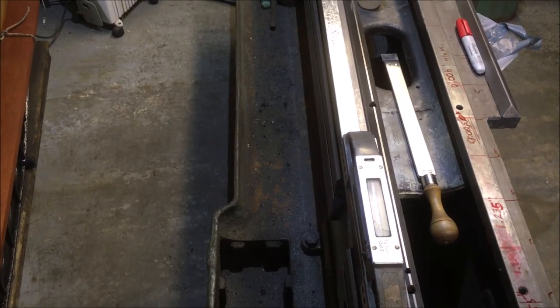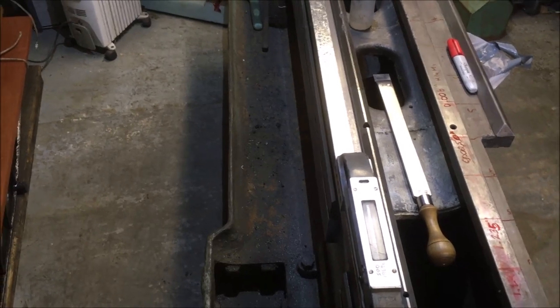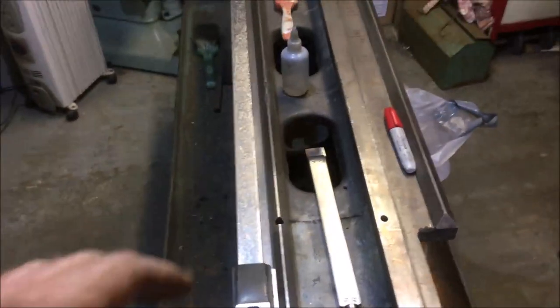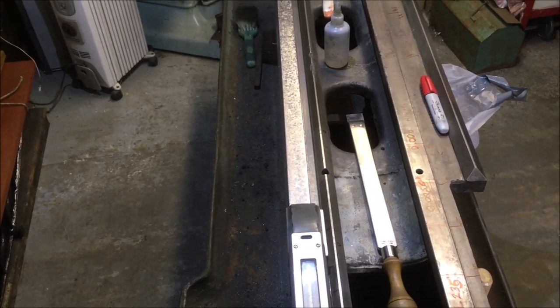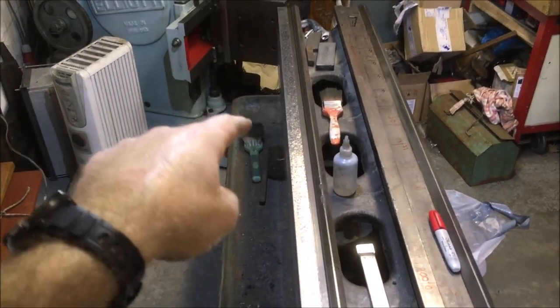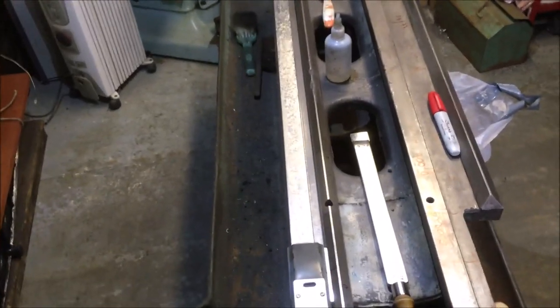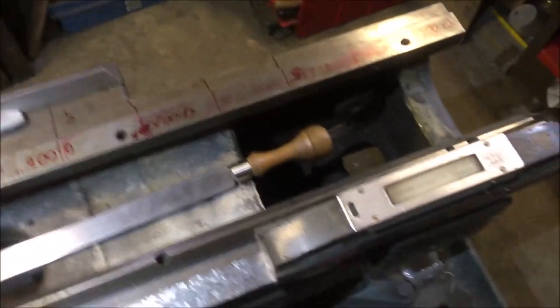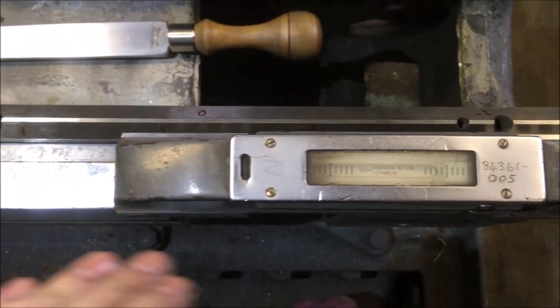It's not easy trying to record it, but basically you could see there the bubble would move half a division with me stood actually on, with my feet on the base of the pedestal up there, which was, for intents and purposes, if one division is half a thou, my 15 stone, which is what, 98 kilos, call it 100 kilos clothed, stood on the end, shifts that end down by around about 2.5 tenths. Now I'm not standing on it when I'm doing my measurements, but Robin's, you know, quite right, it does make an effect. But what I was more concerned about was A, the weight of the spirit level moving down.